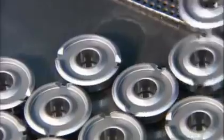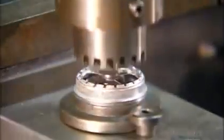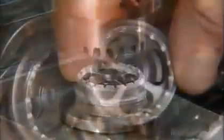Many components are made of powdered metal — mostly iron powder mixed with some graphite and copper. After a press compacts the powder in a die, a furnace fuses the particles. This powdered metal part is the valve through which the piston forces the oil. Steel discs and a spring help control the speed with which the valve operates for varying driving conditions. A stamping tool crimps the end of the tube, holding the spring in position.